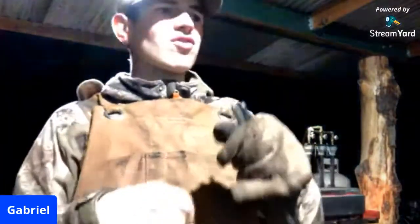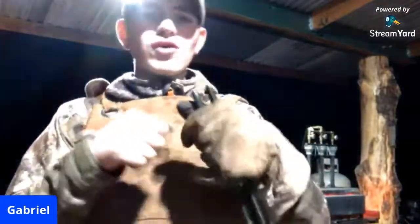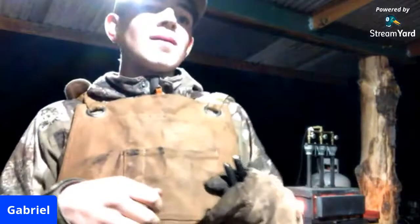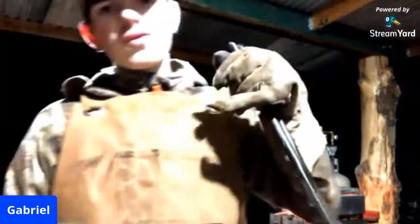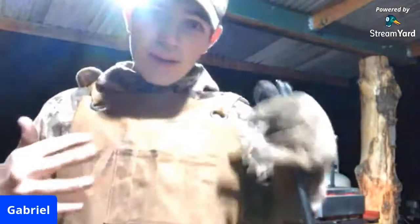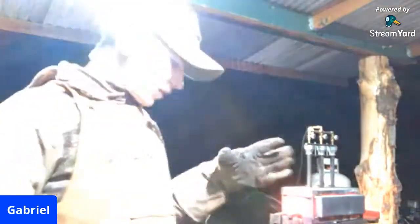But too hard, you get brittle, and that's where, if any of you watch Forged in Fire and you see a blade snap, that's usually where they haven't softened the steel back up enough for it to be tempered and ductile enough to take whatever force they're applying to it. But you want that happy medium. With these, we're going to be making them a lot more ductile and a lot softer than you would see in a high-grade knife. But we're also going to be applying a lot more force when we're wailing on it with an 8 to 10-pound sledge to get it to go through a piece of metal. Quick little thing there, and I'm going to finish up cutting this A2.